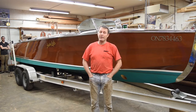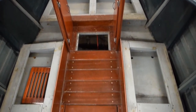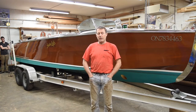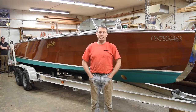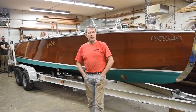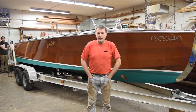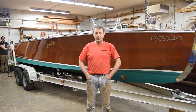Here at Curt Hillman's shop, we're just bringing in this boat — it's mid-March. This is a 27-foot Hacker built in 1989. It's got the West System on it with a plywood inner skin, and it is getting a new bottom because the old one is just delaminating completely from the inside. We're about to pull the engine, probably today or tomorrow, and flip it over to get started on the new bottom. I've never seen too many of the plywood-interior reconstructions that actually last — the plywood just starts delaminating really quickly.